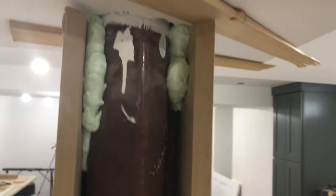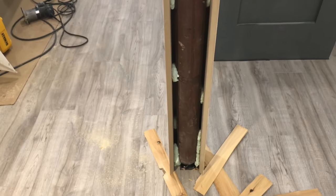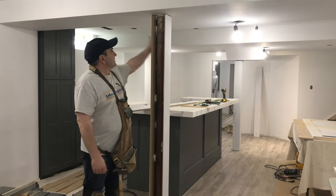I ran another bead and I'm going to fill it in just a little bit more. This is how solid this is — that thing's not going anywhere. She's level. That's how solid foam is — just install the post, shim it tight, no nails, no nothing, but you can feel it, this thing's not going anywhere. So I took the shims off and this thing is solid. The foam is cured.